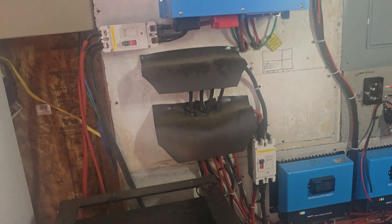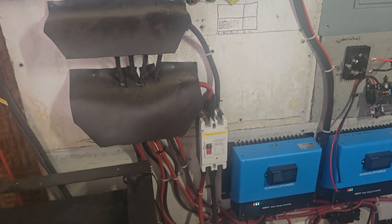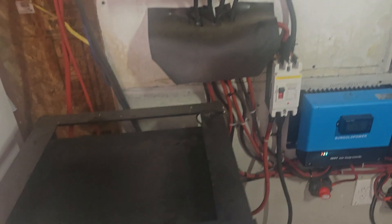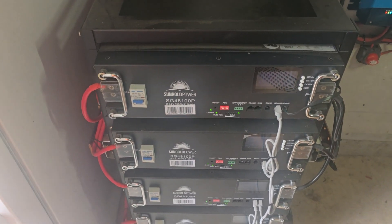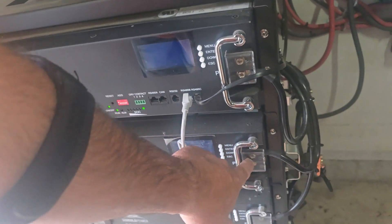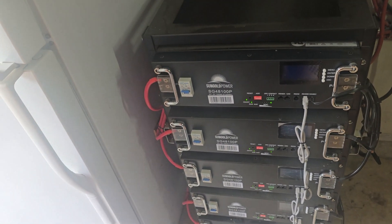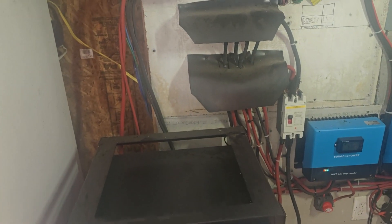When the sun's out, we're pushing close to 250 amps — compared to just 48 amps now. I actually need to go up and clean the panels; I haven't cleaned them in about a month, and after cleaning it'll probably be twice that output. So we're going to add another rack and two more batteries. I'll show you how we build the rack and put in the bus bars on the side. I don't daisy chain — I use bus bars so all batteries draw and charge equally and individually.